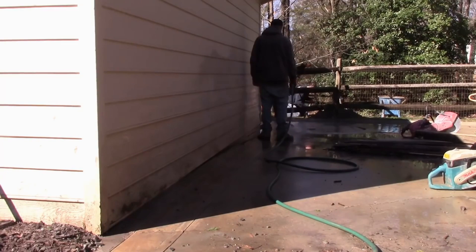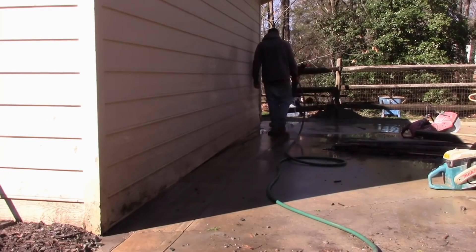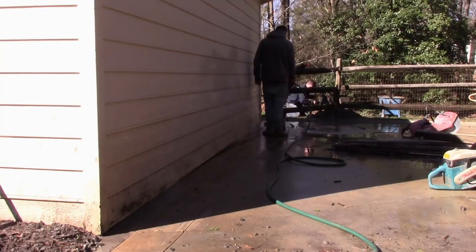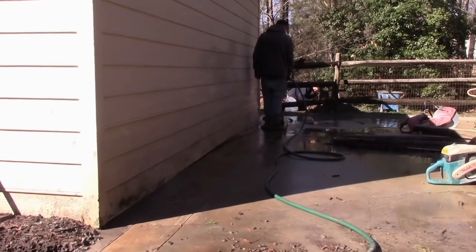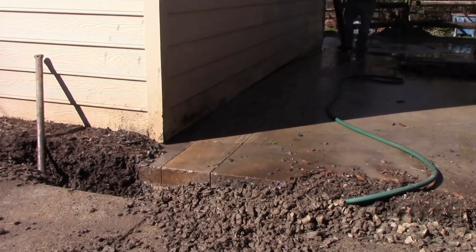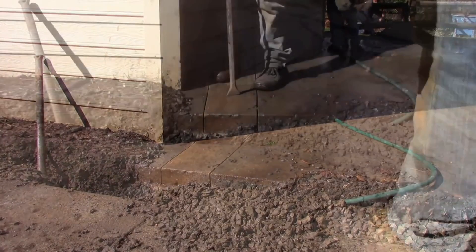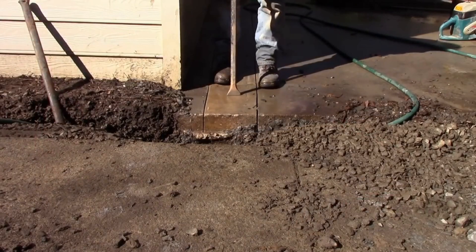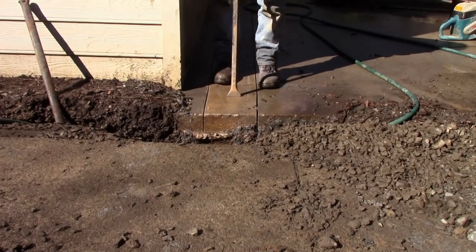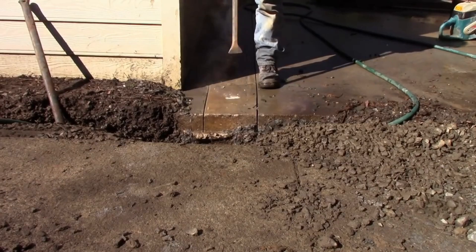A little bit of dust that turns to sludge is pretty much just pure Portland cement. And when it hardens, it will stain quite white. After we're done hosing off the area, we're going to go ahead and take our pry bar, starting right here at the corner — you can see the edge of that concrete — and we're going to just start cracking it with the pry bar. Hopefully that will pop right out of there. If we've cut clear through, we should be able to just start pounding on this concrete and it should crack. We've already got a crack back here, but let's just see. That's pretty thick.